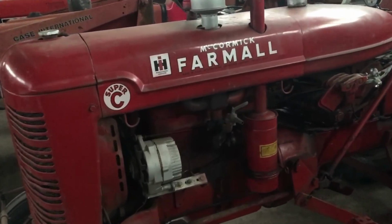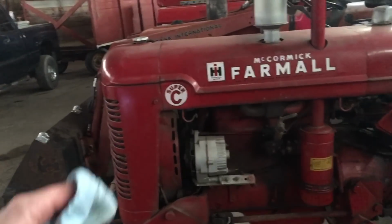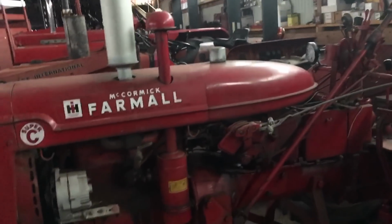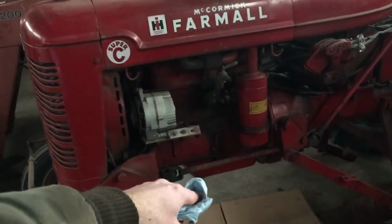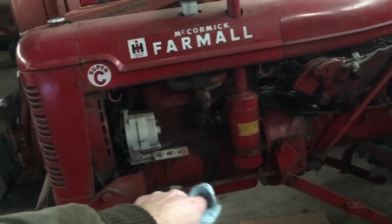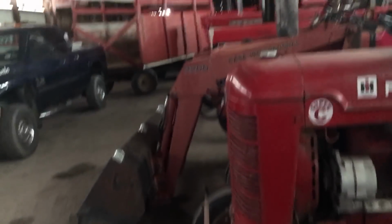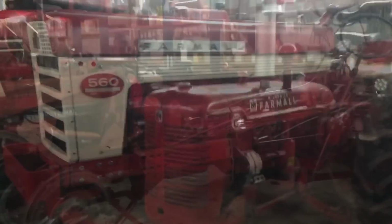I don't want to say I got lucky with it, because like I say, we still could have an issue, but at this point I think we're going to hold off doing anything to it. Just keep an eye on it, make sure we don't have any issues. But that oil is clean in the engine. Yeah, I meant to say, your water's going to be on the bottom of the oil pan, and I checked it at the top here. I did crack the plug and check, and it was just oil. So it is kind of what it is, I guess.